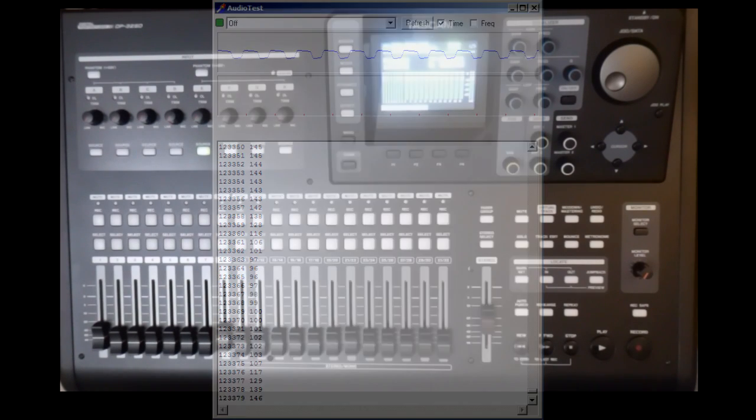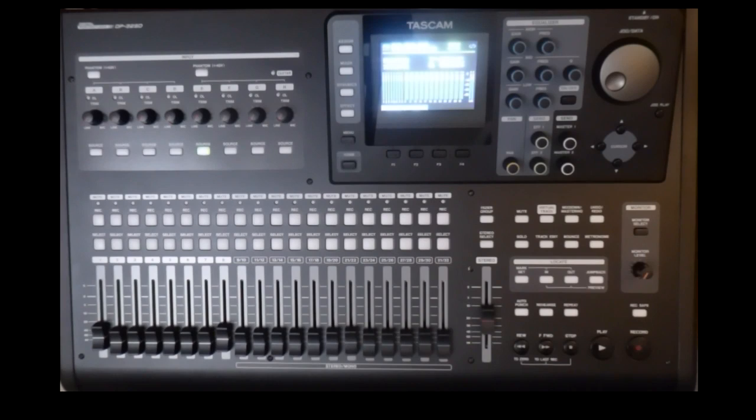Now, in theory, once something is converted to numbers, everything is a piece of cake, as you can store and copy and process these with absolute perfection. But as you guessed, there's no such thing as a free lunch, and in practice there are 2 major issues. The first is, how accurately do you measure the voltage at each snapshot? Let's say you use a single digit to measure the voltage. So you can measure 1 volt, 2 volts, 3 volts, and so on.